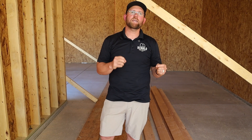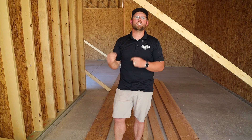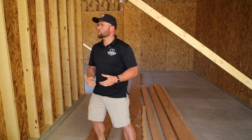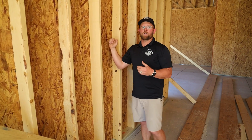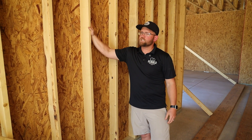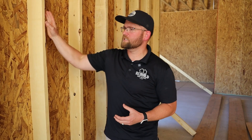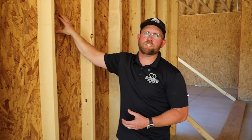One of the things that really helps to alleviate racking issues is shear walls called out on our engineering set. A shear wall helps with various lateral loads. In this case, we have two walls with two-by-six framing members running the exterior wall, and instead of just that, we add shear value by adding four-by-ten-foot sheets of OSB — a minimum of three-eighths, increased to seven-sixteenths on our builds.